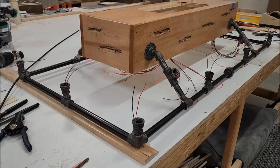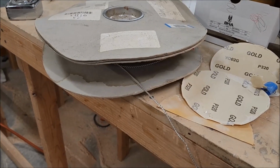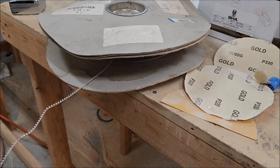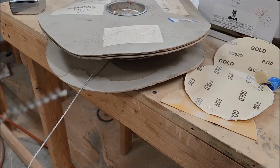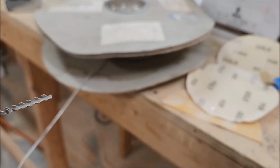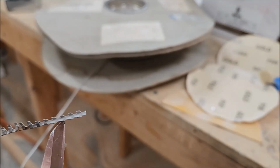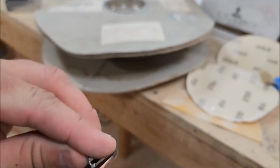But anyway, so yeah, got to splice all those wires together. Now with such small wire, it's not entirely easy, but it's not really difficult either. I will be using these TE 800-2500 crimp splices. That is what they look like. Usually you just use the one to crimp it, but I'm going to be cutting them in strips of 3 so I could use an insulation crimp as well as a conductor crimp. So basically I need 3 of these for each wire.